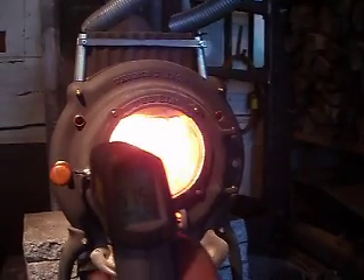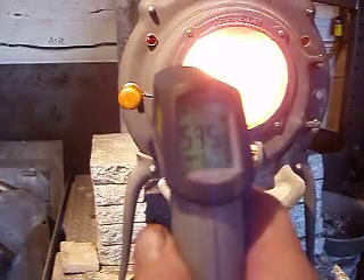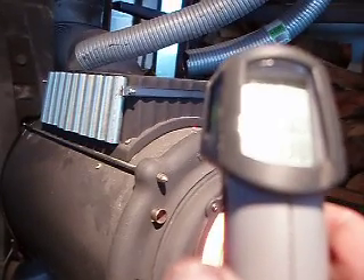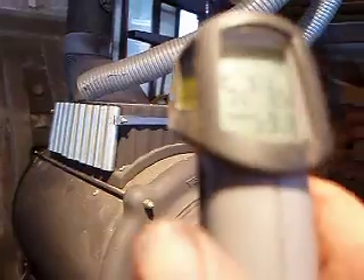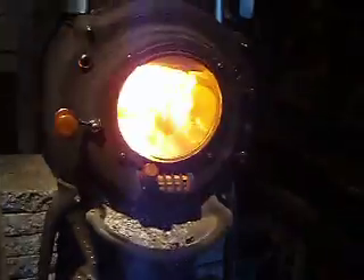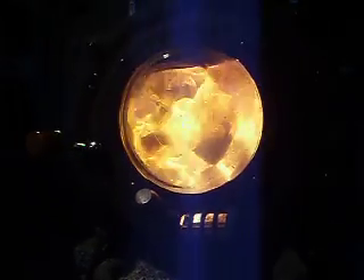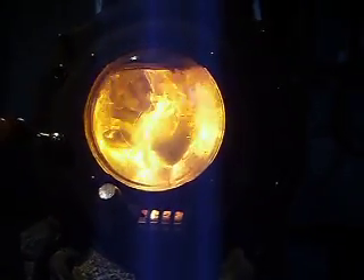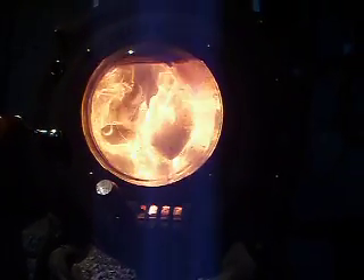This is much like the principle of the free flow stove, which I'm an ardent admirer of. Now I can take this heat gun and take a measurement inside this tube — and that's in the 500s. The skin temperature of the barrel on the side is in the upper 700s. Right here at the top of the barrel, also in the 700s. The stove is not what I'd call hot yet — it's about 4 or 500 something on this top griddle — but it's on its way. What we like about these tubes being on the side of the stove, right at the corner where the baffle meets the barrel, is that the barrel tends to get very hot. The idea is to get the stove to absorb the heat from the fire and radiate it into the room, as opposed to letting it go straight up the chimney.